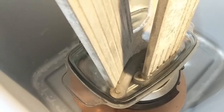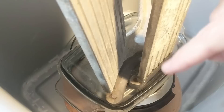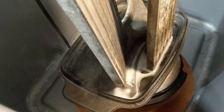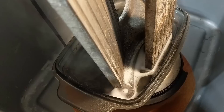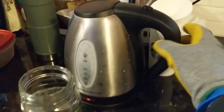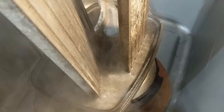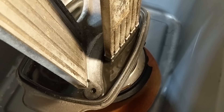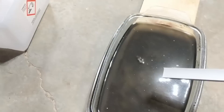Side number two is going to soak overnight in the battery acid and alum salt, and tomorrow we'll try to boil this in a new container — we're in a Tupperware tub this time so everything should be okay. Today is now tomorrow and this has been boiling for about an hour and a half. Success! No exploding glass. The parts are done — there's no more steel left in the aluminum. Now I just gotta put this toxic waste back into the battery acid container and save it for the next project.